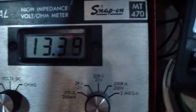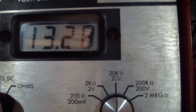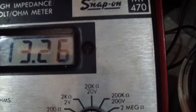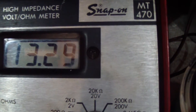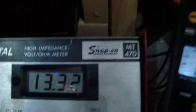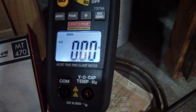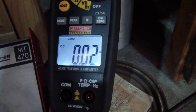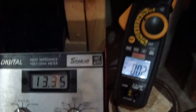Okay, there you go. The element in the dryer came on — that's why we see the voltage drop to 13.3 volts. It's the same at the battery, and there's activity there: it's constantly charging and discharging. The capacitors show a pulsation. Thanks for watching and have a good one — bye!